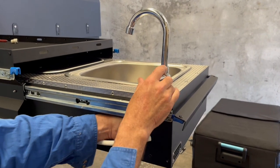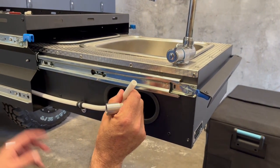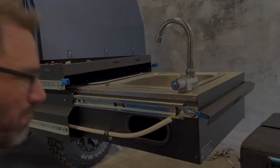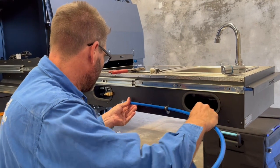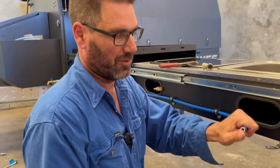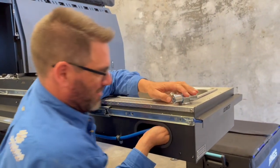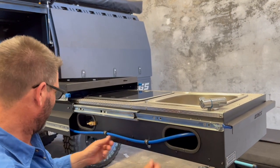So I've just taken that thing out and unscrewed this here — it was screwed onto the bottom. I'm thinking if I can get a John Guest fitting onto that and replace this pipe with John Guest, because that little bend where the white pipe pushes onto that other one, it's leaking because it's slightly bigger than the John Guest ones. I don't know what this is, but we'll try and get something to match. So I put the male and female on there. I've cut this the same length as the pipe we pulled out, so it fits in there because it's slightly smaller — that shouldn't be an issue. I'll push that all the way to the back, and it's got the little sleeve in it so it can't collapse the pipe. I'll push that stem adapter on there and then all I've got to do is get up inside and push it up into that John Guest fitting, which is quite difficult to do. Now it's on there. Here's a tip for you — before you put the sink in, change this thing over so you've got access to it and it becomes a lot easier. That's all in there and it's looking pretty good.